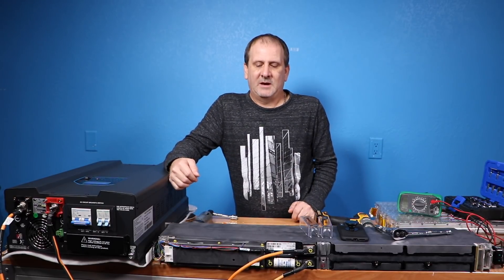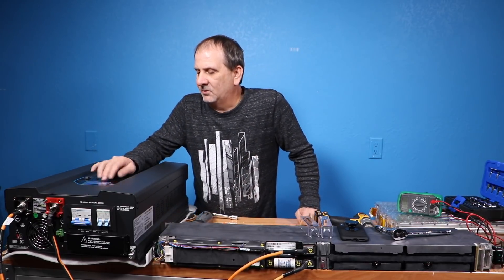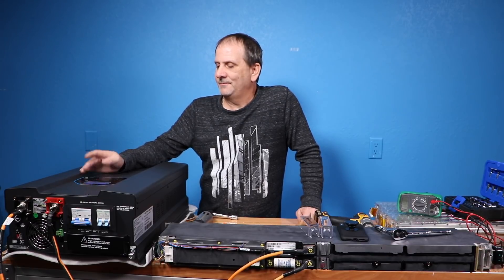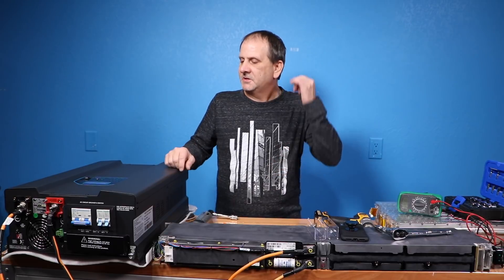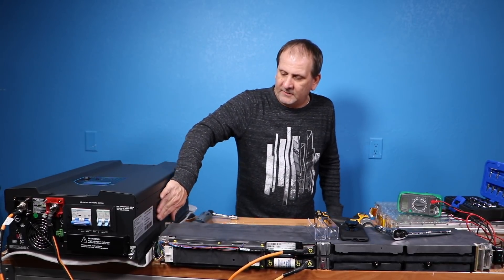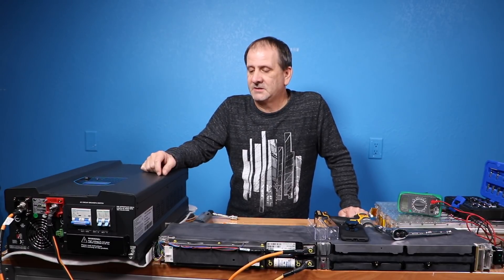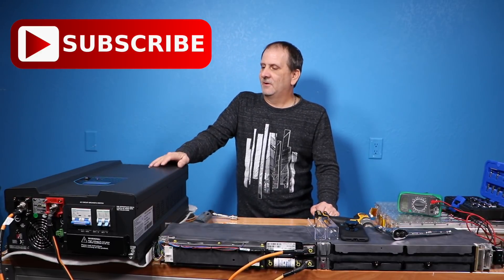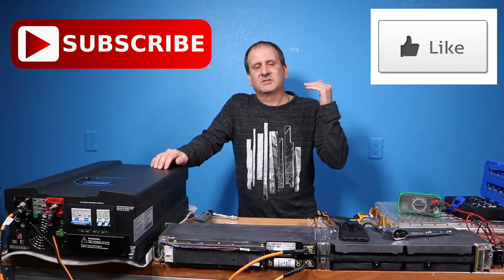I'll get into more detail on the next video — this was just a simple 'let's turn the thing on, get it running, make sure it works.' It's still holding at 58.4 volts, only lost about two-tenths of a volt since it's been in battery saver mode. Sorry for such a sloppy video — I just wanted to get this out of the box, hooked up, make sure it worked, and share that with you. Don't let the bigger equipment fool or scare you — it's just a bigger inverter. This one runs 12,000 watts versus 1,000 or 2,000 watts, and it has a 36,000-watt surge for 20 seconds, which is what's so killer about it. Any questions, please put them in the comment section below.